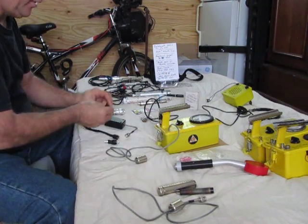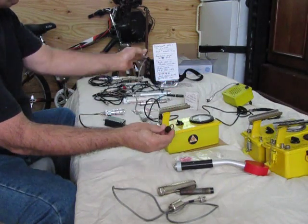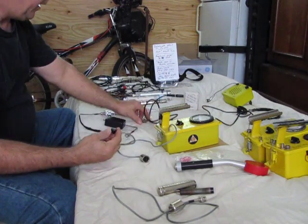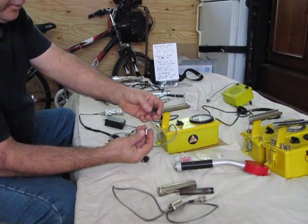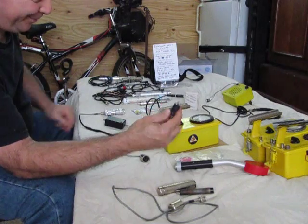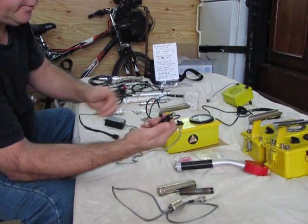The original socket base for the CDV700 was an Amphenol 78S3S — I've got all the parts listed. These can still be purchased. If you take this and a BNC panel mount, pin one is hot (the center), and pins two and three are ground. I've soldered these together to make an adapter that plugs in and gives you a BNC port.